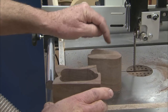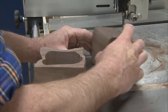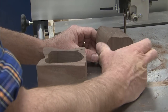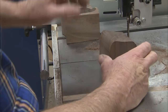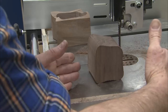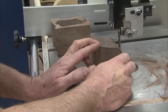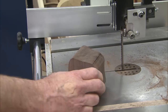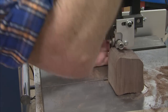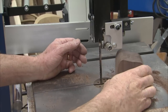Final thing I have to do is cut this piece off. You'll see why when we do the glue up. So that's rock solid, that's my clamp. It's a good idea when the workpiece would get smaller than this, or if it were to rock, use wooden hand screw clamps close down on the workpiece to keep it securely to the table. But I can secure that. I'm in good shape. Okay, but I have to raise that assembly. It was just down just a hair too low.